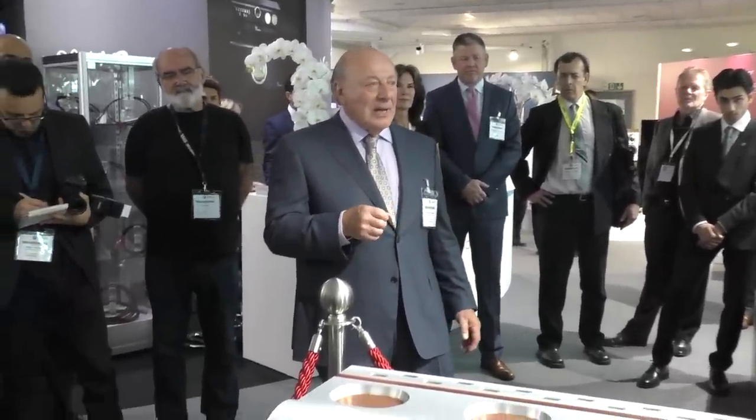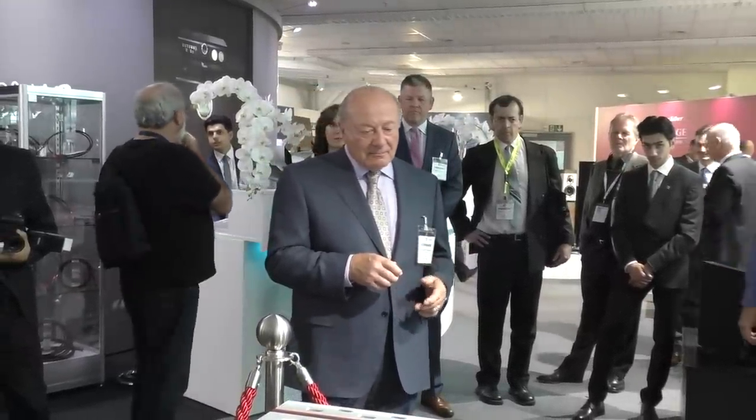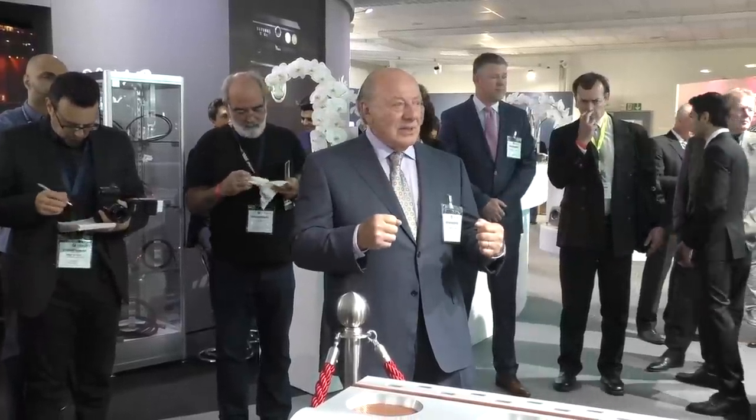Along with an extraordinarily quiet power supply, we have a multiple domain power transformer that's laminated in a certain way to make it have no noise. It's surrounded by wraps of silicon steel and potted into a steel can so that it's totally quiet electrically and mechanically. It's got 600,000 microfarads of capacitance in the old way, with big can capacitors that you don't see so much anymore because they're so expensive. But they have their own problems. They resonate. They're big hollow cavities. So we have an acoustic damper built in that clamps them in and grounds them to the chassis so they're dead quiet. And that's coupled with big copper bus bars.